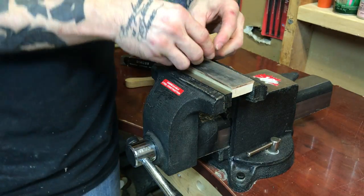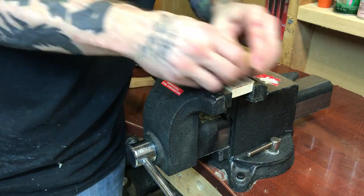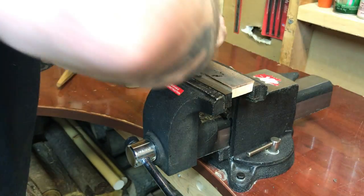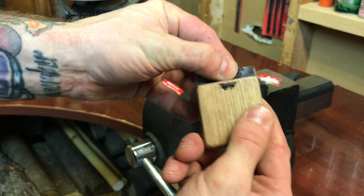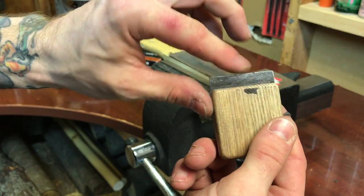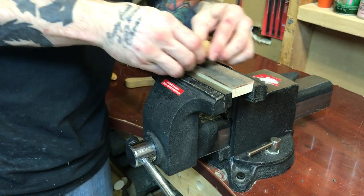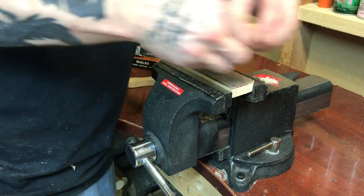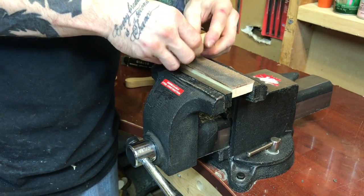It just cuts that material away — that's all, just metal that's sitting in the leather, metal and compounds mixed together. When you're stropping your knives you're trying to take a little bit of metal away, so you don't need to add any — you want to get as much of this out of your strop as you can. As you can see it's coming off really nicely. This wouldn't be cutting at all if this edge was smoothed over, which happens fairly quickly in my opinion. But you should be able to get this down to almost bare leather fairly quickly.